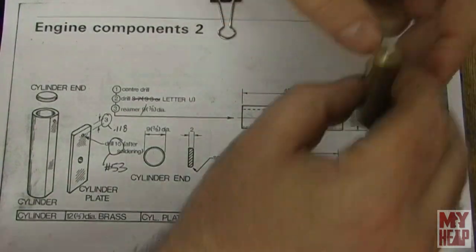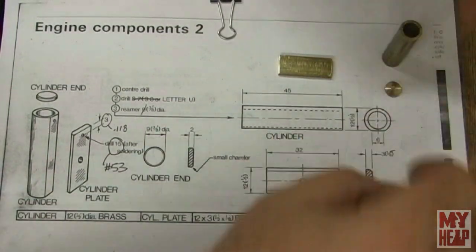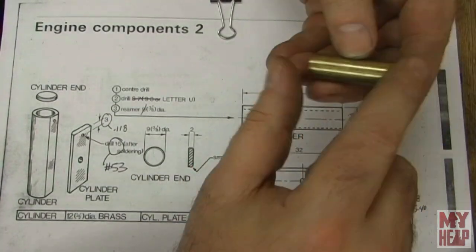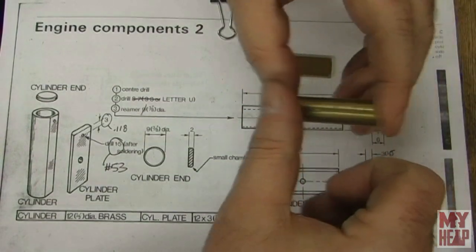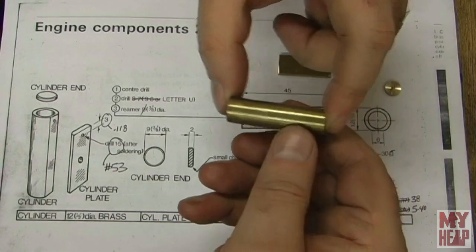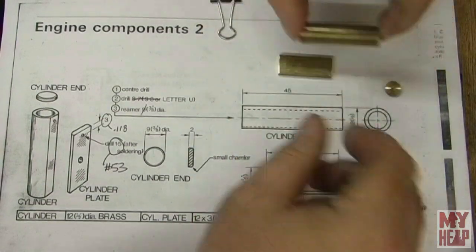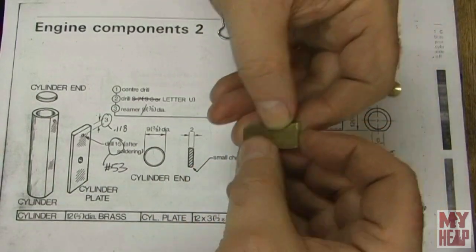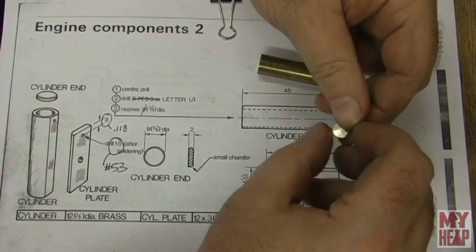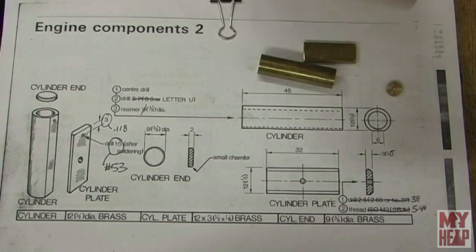All right, so I will point the camera and give a general idea of what I'm going to do to the handwork, the filing that I'm going to do on this, but I'm not going to bore you to death because, look, all I'm going to do is just file that, right, until it's flat, and then I'm probably going to put a piece of sandpaper on my surface plate so I kind of get it nice and flat, and then I'll file this to where it looks, you know, how it needs to be. And of course, the head, there's really nothing to do. I'll take this little parting nub off when I'm done soldering the head up.